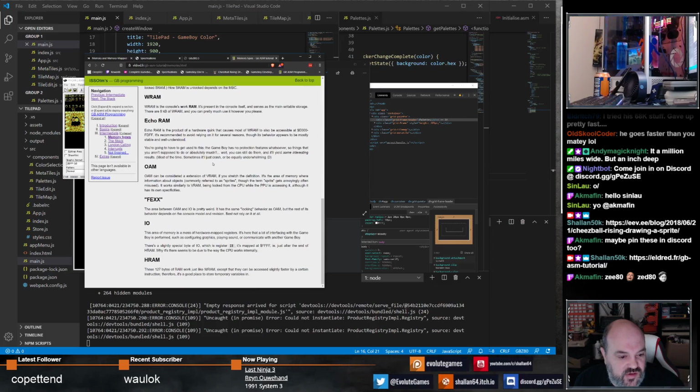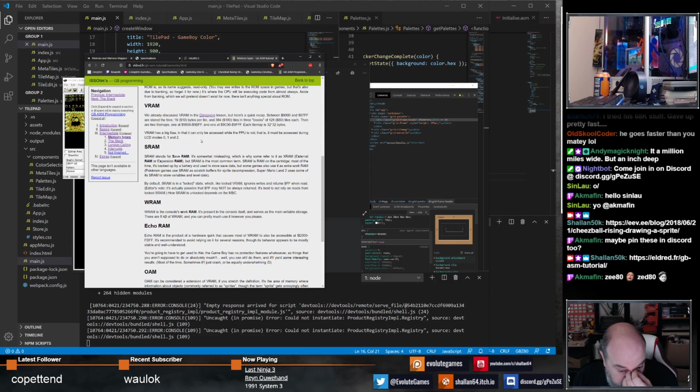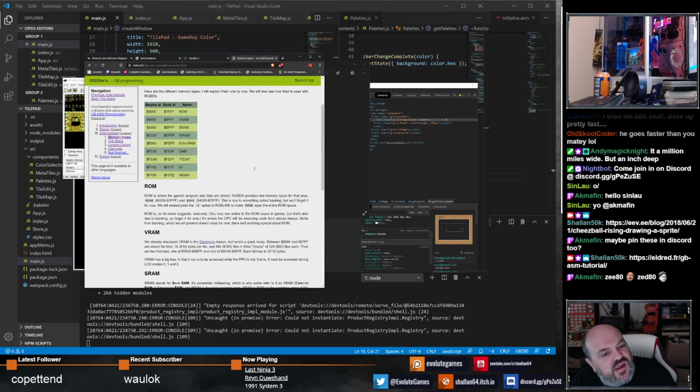It also explains the memory. The memory is another thing I think I probably need to read again. I think I've got the hang of it now. It's all about banking in ROM and RAM at the right times. I probably don't need to bank RAM in. I think, what is it, 16 kilobytes of RAM is probably enough. No, not 16 kilobytes. What have I got? I think I've got 8 kilobytes here. I think that's probably enough. I mean, I don't need a lot of RAM.